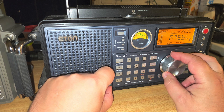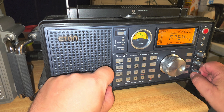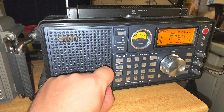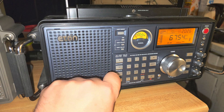That big fuss isn't for nothing — the reality is the radio is not precise enough to give you the correct frequency. A lot of people also fuss with the BFO trying to get the proper voice, and when you get used to it it's easy, as you see here. But the number of comments I get from people saying they have a hard time getting voices correctly with a BFO — and then there's the upper/lower sideband thing. The majority of everything is upper sideband, except the ham bands below 10 megahertz and a few exceptions.